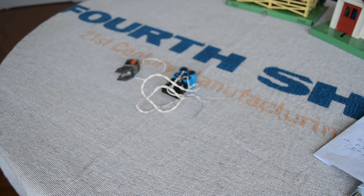Why might you want to run your Lionel trains on DC current? One of the more obvious reasons is you don't have AC current available. Or, if you happen to live in Europe where the AC powerline voltage is nominally 240 volts, there just aren't transformers around that will run on 240 — Lionel built a few but they're very scarce. What you're relegated to is a DC power supply suitable for laboratory bench use, adjustable, and compatible with a 240-volt AC input. These are available from major electronic distributors, some even programmable, ranging from the low to mid hundreds of dollars.